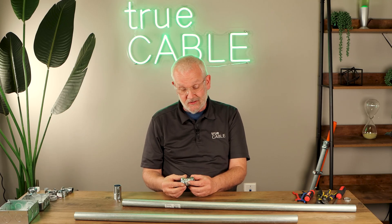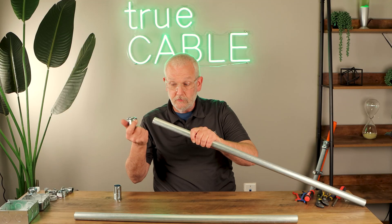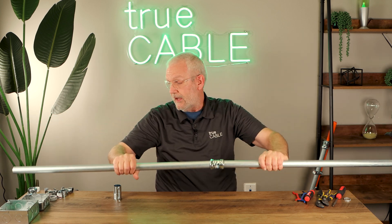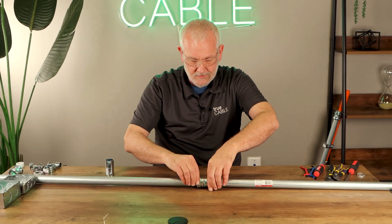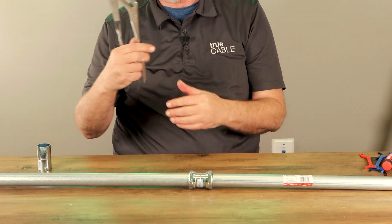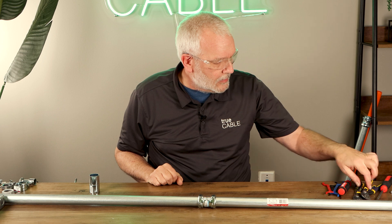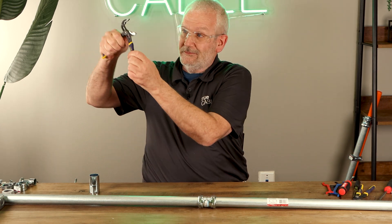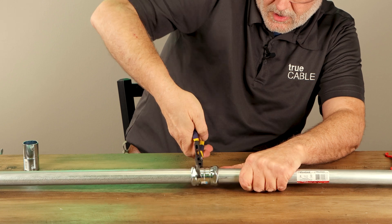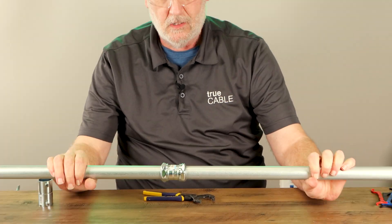I like the compression type better. I think they make a more positive connection, and they have higher symmetry, which makes me feel like my life is in balance. So I choose these. Slide one on each end and then tighten the fittings. This is one-inch pipe, so we're getting into some pretty large tools. You can use big pliers or a big adjustable wrench. I use these channel-lock style pliers — even though they're small, they open up big and the jaws fit really well around even one-inch connectors. Tighten those and you have a connection.